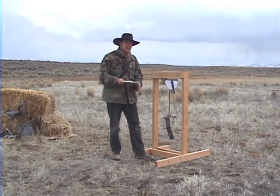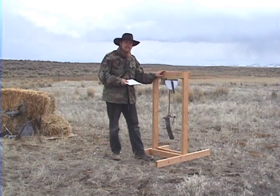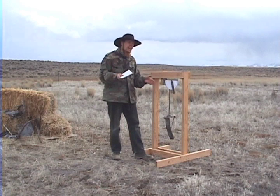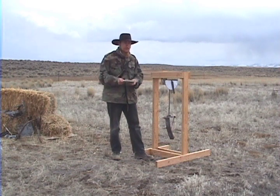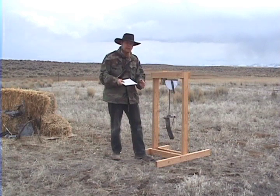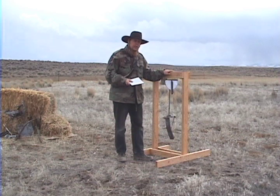Between those two effects, I think that probably accounts for our observed error of about 20 to 25% here. Nevertheless, this device — especially when we can calibrate it to chronograph data — does give us a general measure of the velocity of the bullet. A ballistic pendulum like this can allow us to take some types of measurements that we can't take with a regular chronograph, which is what I'll be using it for in future episodes. It certainly provides at least a basis of comparison to measure relative momentum transfer of different types of bullets. I've got big plans for this device coming up with some other ballistic testing. But until then, thanks for watching The Idahoan Show.